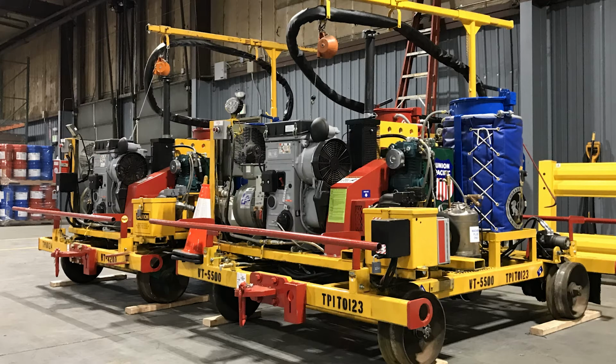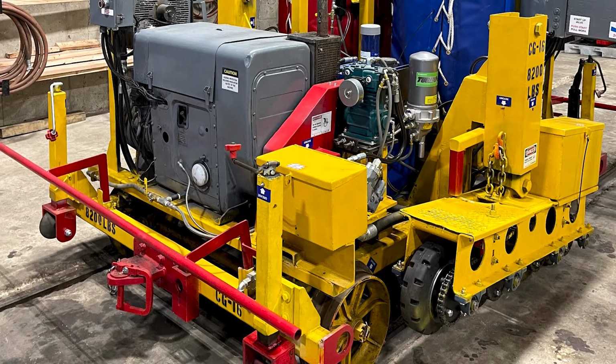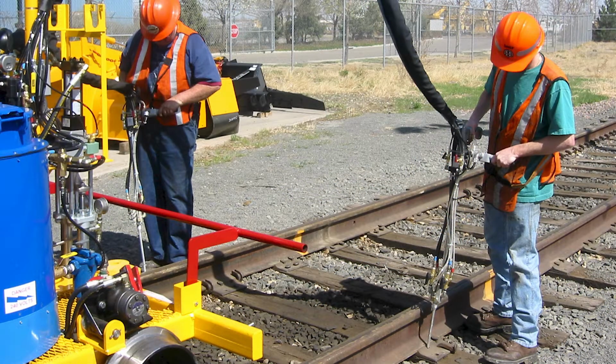Encore's walk-behind tie plugger provides the flexibility and reliability to meet the demands of all types of production tie plugging applications. It offers a single or dual crawler drive. The dual crawler drive system eliminates repositioning the machine in a rail replacement process, allowing the machine to travel in either direction. Work speed control is adjustable, and stop bars in the front and rear maximize safety. Dual compound dispensing guns increase plugging speed and efficiency. The single compound pump ensures a consistent mix.